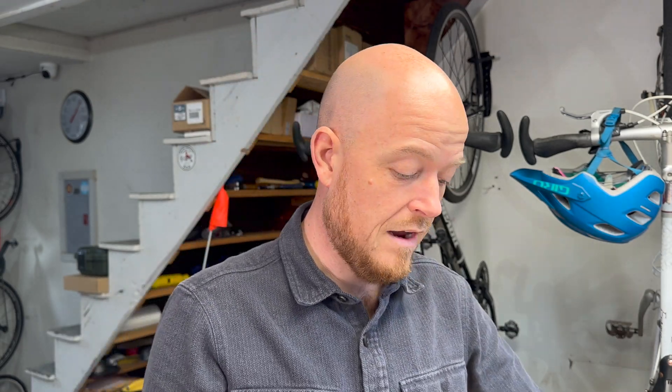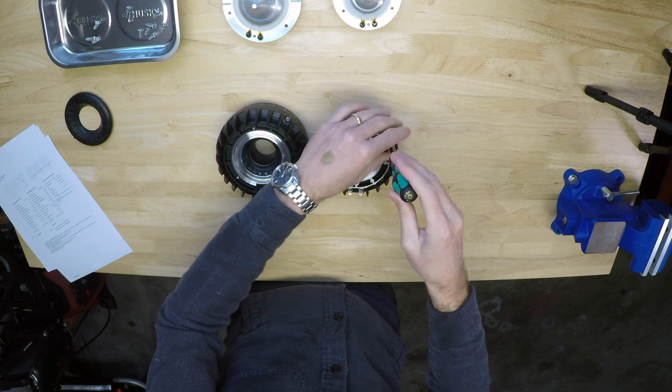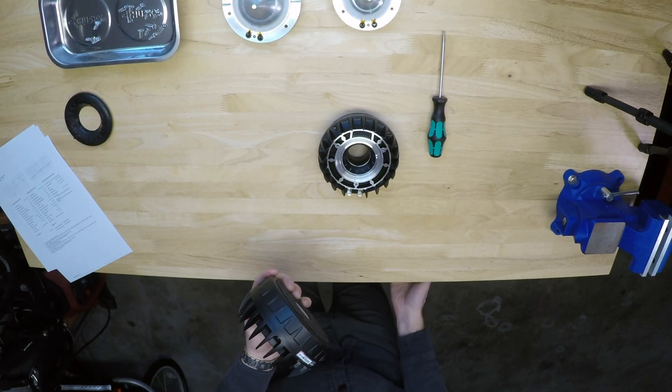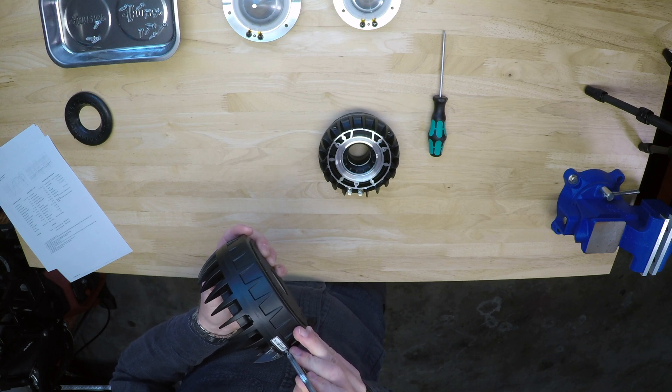There are a couple of challenges in the smaller DCX354 driver. Challenge number one is you want to keep as much low-frequency capability as practical, but here you are losing a lot of diaphragm area going from a four-inch to a three-inch coil. Challenge number two is because the high-frequency driver is smaller, you actually need much more high-frequency extension out of the mid coil to meet up with the high. It's not really practical to get more than maybe four octaves out of one diaphragm — that seems to be the limitation for a lot of our high-frequency driver designs — but we found a new trick, which is why it's subject to a patent.